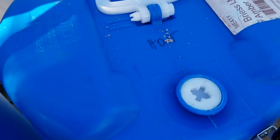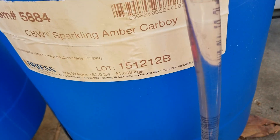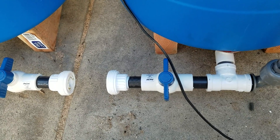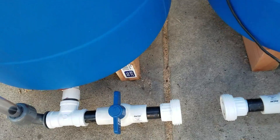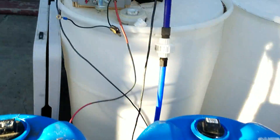So inside this barrel, which I set up here, you can see this tube — it's actually a flexible plastic tube — and the water level is right here. I didn't fill it all the way so I can tell how much water is in the tank at all times. It comes down here, and I put a connection on the bottom of the barrel, teed off, with my ball valve there in the off position. That comes over to a union, and the one beside it here is the cold water barrel — there's no water in this one at all right now.